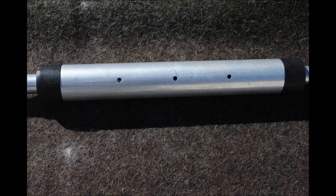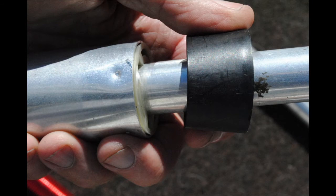What the heck can go wrong with a trap? I'm holding the outside capacitive reactance sleeve, and that sleeve covers the internal coil. We always want to make sure that the holes that allow moisture to drip out are facing down — gravity rules. The holes are facing down, yet the trap antenna is still intermittent at the 15-meter band.